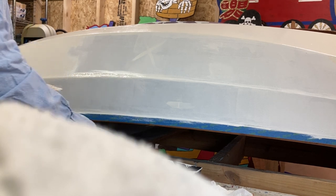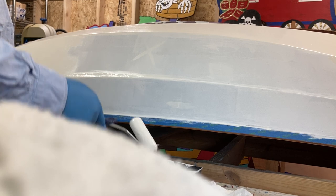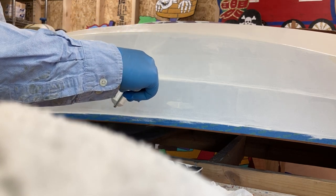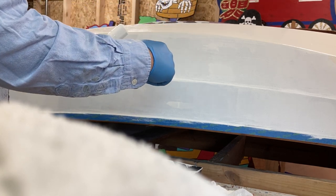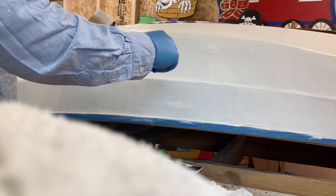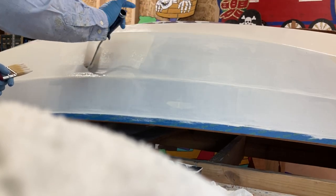So let's talk more painting. I'm just lightly putting this paint on the roller. I'm not mashing down. And that's the same way I'm going to put the paint on. And for me, when I paint, it also matters which way this roller frame is turned. Because if I'm going to go down like this, for some reason I put more pressure on this corner of the roller, and there's sometimes a line and lighter pressure up here. So here we go. And this is just fingertip pressure. This is not Marine Corps pressure, even though that's how I started painting.